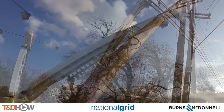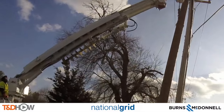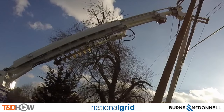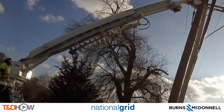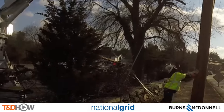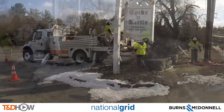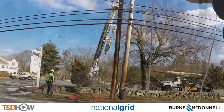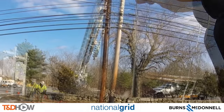The crew works together on the rope, tilting the claws down to grab the pole, then calling out commands — 'sting out,' 'left hook,' 'guide him' — as they maneuver it into position. Next, they break out the plumb bob to check vertical alignment, with the crew chief moving across the street to verify it from another angle.